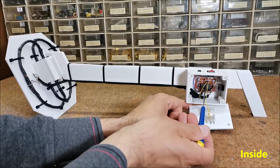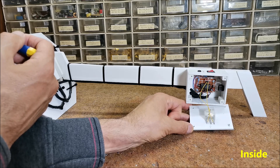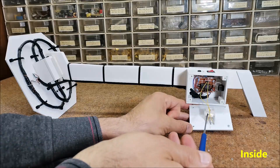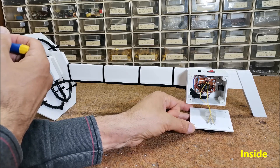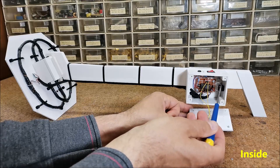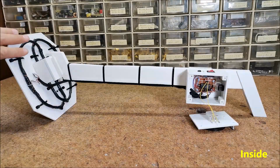The main component is the TL-084, a general purpose quad operational amplifier. You can also use TL-074 or TL-064. Next, a small variable capacitor with capacitance of about 100 pF, taken from an old portable AM radio, a crystal earpiece connected to a jack, and search coils.